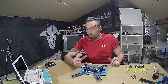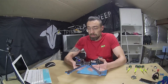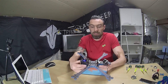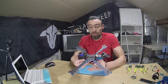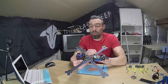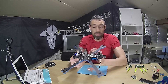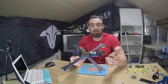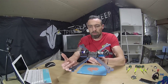I took off all the parts — a few are still on it — but I can show you why I chose this frame. The frame itself is big enough. My normal frames are center-built, but now I've got the front and back on it so I can have more room to put more components. In the center I've got my screws ready to mount my flight controller. In the back I designed a little mount — a little tower — for my VTX and my lost alarm. And in the front you've got your camera. Enough room to build everything.